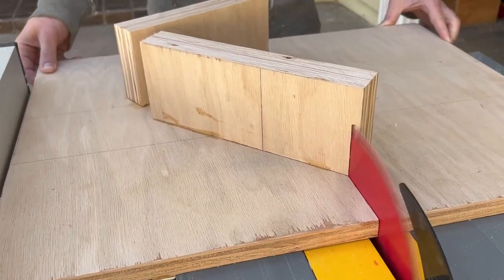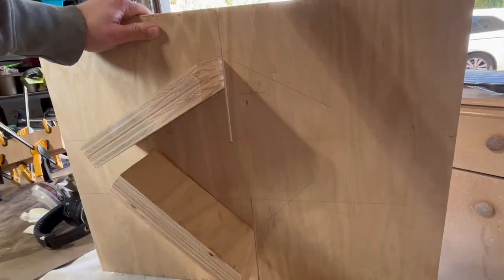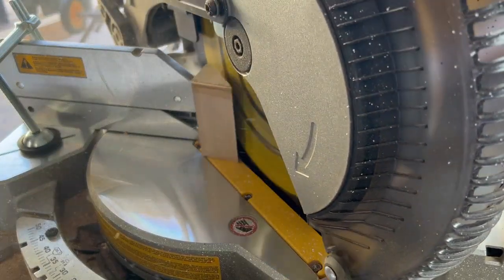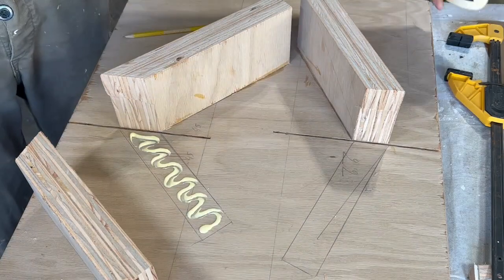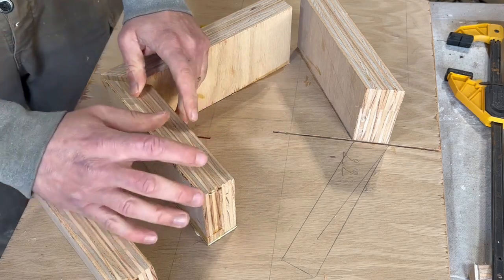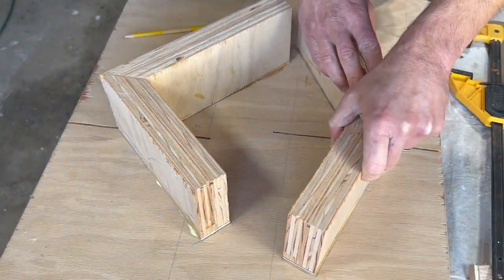Here to the cut, because my handle is pretty tall, I have to finish the cut with my Ryoba handsaw, which I love. And these are procedures that are pretty simple. At this point, the most important thing is to be precise in gluing these pieces. Make sure that here are perfectly at 45 and 22 degrees.